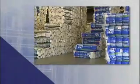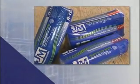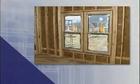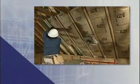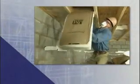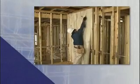Johns Manville makes fiberglass products for every insulation need and preference. Batts are panels of insulation that Johns Manville manufactures in a variety of lengths, widths, and R values. Batts are made to fit within most regular wall framing, which are usually spaced 12, 16, or 24 inches on center. In addition to batts which are pre-cut to specific lengths, you may find insulation in rolls.